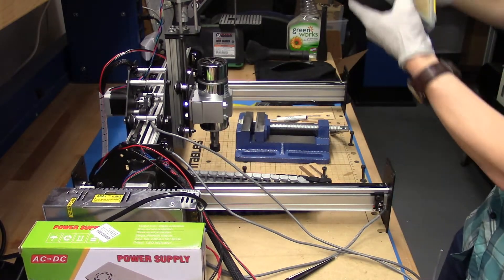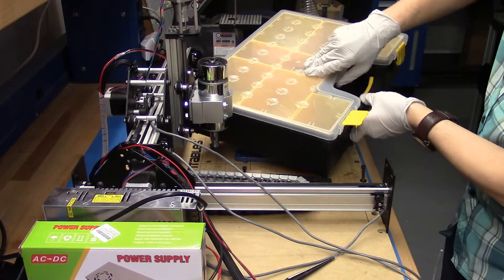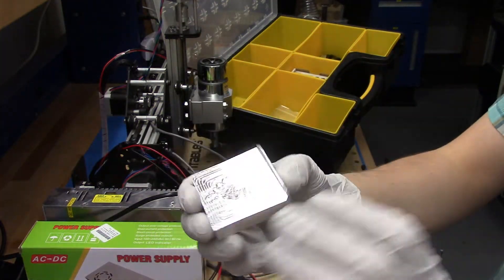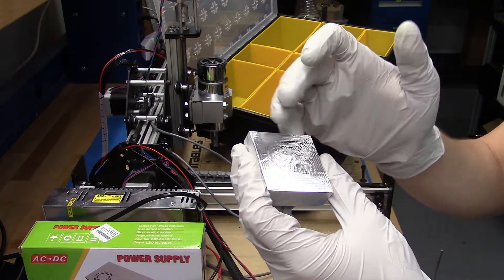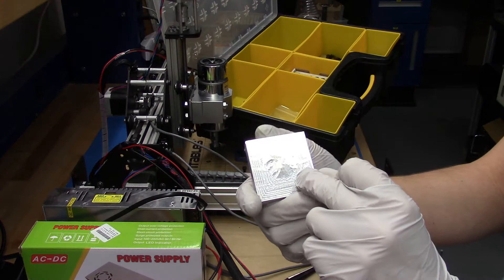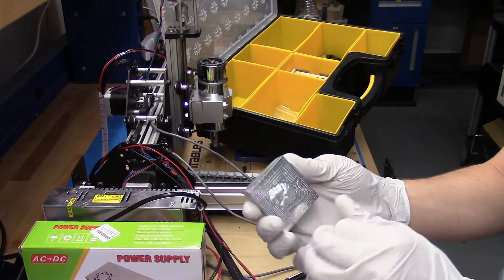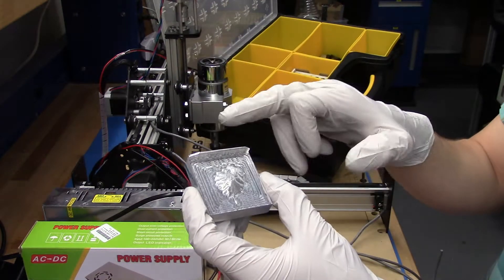One of the things I'll show you guys is what I've managed to do with it. We're in Washington, so I wanted to machine out Mount Rainier — this is a 10 kilometer by 10 kilometer square of Mount Rainier. It failed halfway through, which is partially my fault and partially the CNC's fault. At one point my computer fell asleep, it disconnected, and the CNC stopped, which is unfortunate. I was using Fusion 360 to generate the G-code and then imported it into Easel using the G-code import option. The issue with that is you can't change anything aside from the speed percentage, but it creates some really nice finishes. This last part I didn't center properly, so that was my fault.